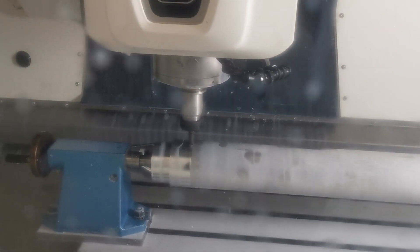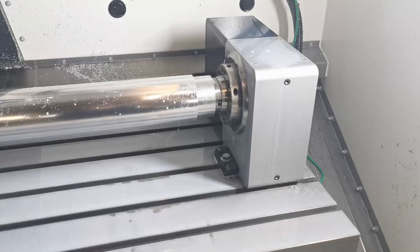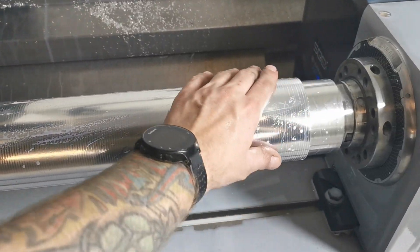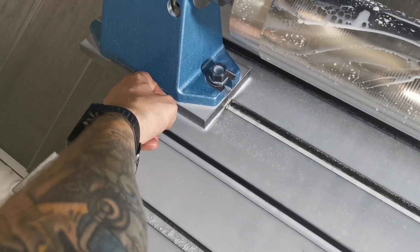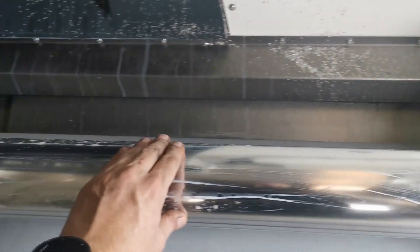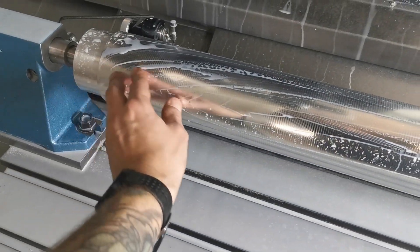This is the first test pass to check if everything is aligned. The rotary should be able to do around 50 RPM but this is not 50 RPM. Check it out — this is the first time I'm mill turning. I had to shim up the tailstock because this needs to be within three hundredths of a millimeter all the way down, so I'm pretty happy with it.